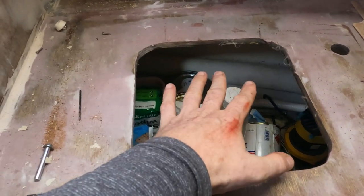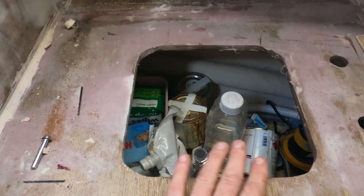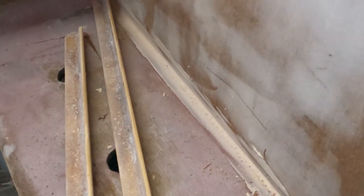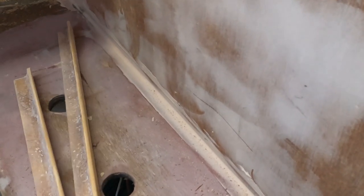Just to orientate you - when I took the veneers off I found lots of gouges in the wood where wires have been run, and some voids where you can see the first level of fill going on. This wooden panel is what's going to secure the actual locker front, and although it's softwood it's reinforced with glass fibre. The large aperture is where the sink was - I've pulled that out to get some medium density filler onto the surface for a nice tidy plain finish. I really dislike silicone caulking in boats - it just comes off - so instead I've put in a fillet with low density filler to ensure water can't get down there.